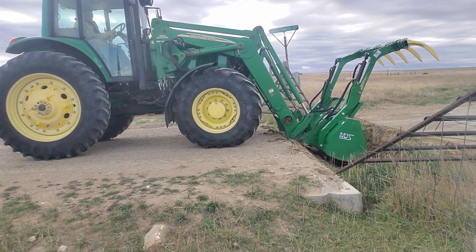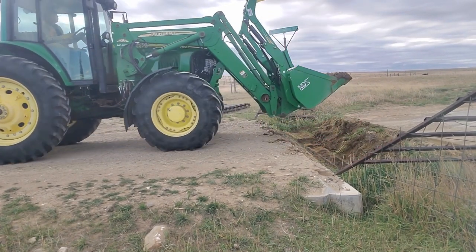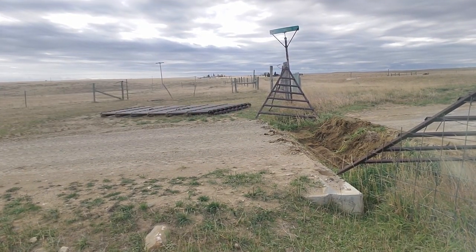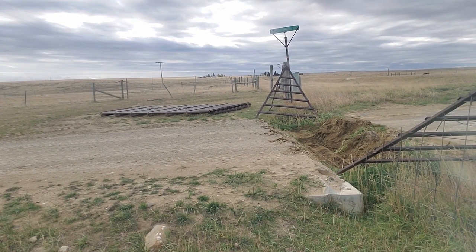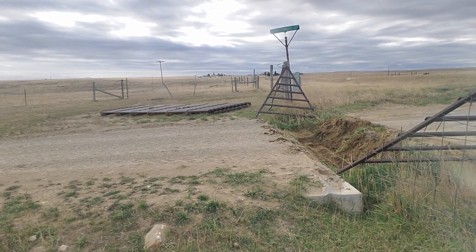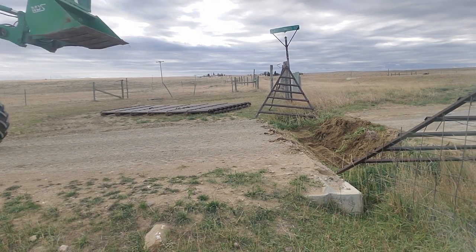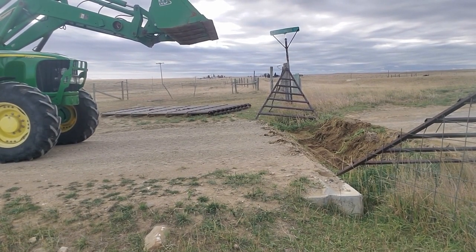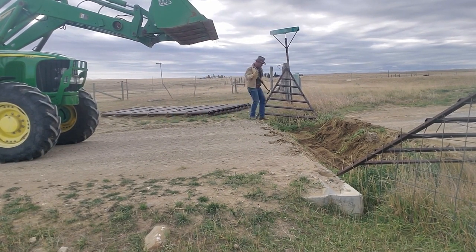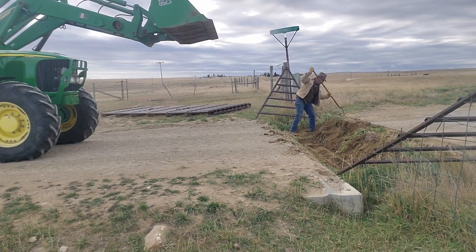He's getting really big chunks out and being careful not to scrape the concrete barrier, going very slowly. Remember we're watching at two and a half times speed. With hydraulics you need to feather the controls — if you start jerking that stuff around, you blow hoses and joints, and it's harder on your equipment. He's going to park and step out to assess how much still needs to be done before clearing off the top part of the barrier.